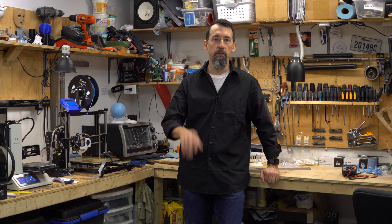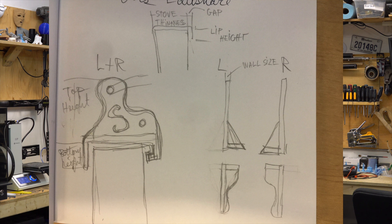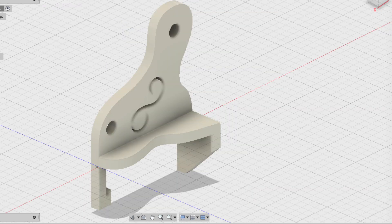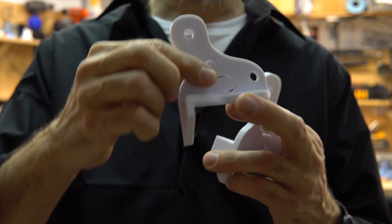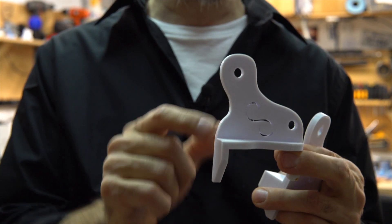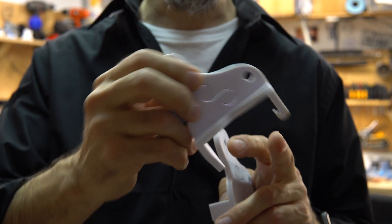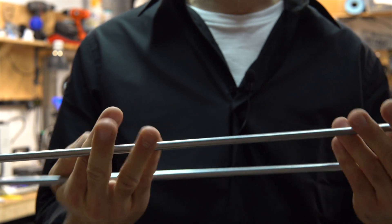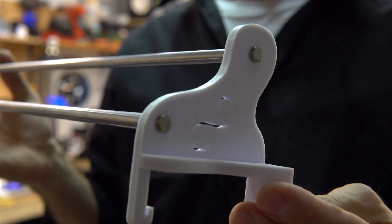It's not really sturdy — they can fall off if you move the stove. So I wanted something to hold those in place. I drew up a sketch, did some measurements, put it into Fusion 360, and made the design. I had a couple of 8mm rods left from the 3D printer, so my thinking was to use those. This is what the printed product looks like.